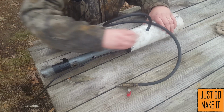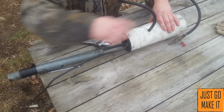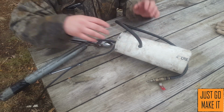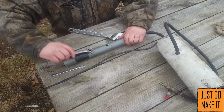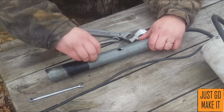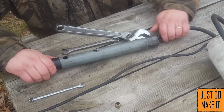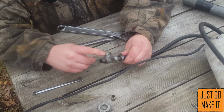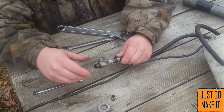Okay, so taking this burner apart consists of pulling the pipe out of the blower. Now, in previous videos that I've made, you will see where I showed how to make this blower. Now, in the pipe here, I have a 1/8 inch to 1/4 inch little pipe adapter and a washer, and feed this out of here. Then I have a 1/4 inch T, and this T just so happened to have a short little nipple in it, so I just left that in it.